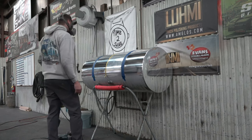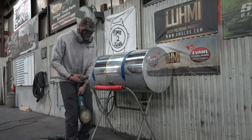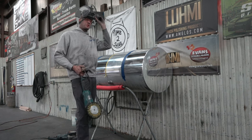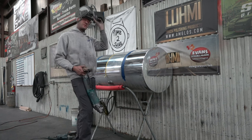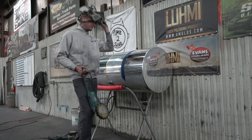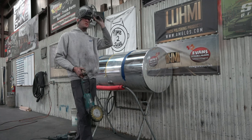Switch over to the regular brown. Now, like I said, switching over to the regular brown, I'm going to wreck this buff. It'll never be a show buff again. We don't currently have any show buffs set up, so throwing a little regular brown over this one just means it's going to be a regular yellow and brown. So I'm going to cut this section here, and then I'll grab it handheld and show you guys the difference in hash marks up close, and then we'll color each section.